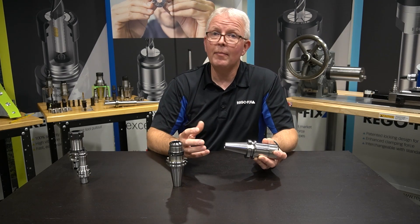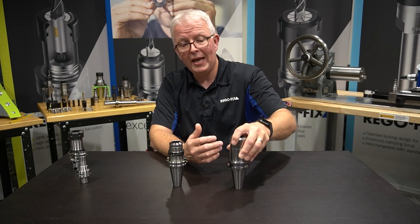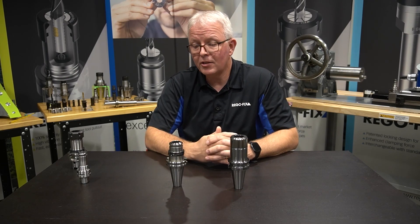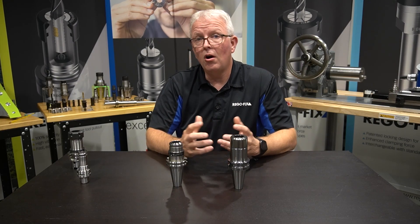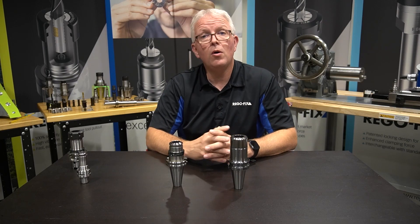When you or your shop is looking to move into RFID tool holder tracking, make sure you know exactly where you want to have that pocket. I would go ahead and create a drawing, or ask for a drawing from your tool holder manufacturer of where that pocket is located or where you want to put it, so you have a reference point going forward. Either way, RFID is a very good way for tracking tools, and in the future we will do a short tech chat video on how it works and why you might want to think about it.